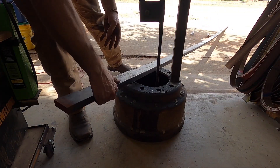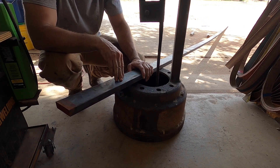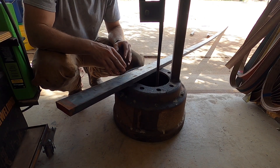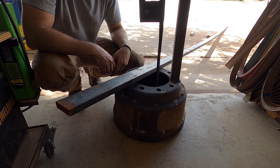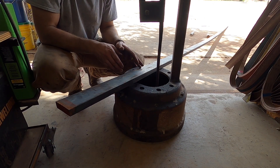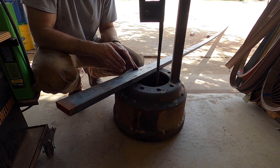I do know what happened. I cut a little slice off the new bar of stock and did its own heat treat test – a very simple way to make sure the steel you're working with has adequate carbon to harden. This is a brand new 20-foot replacement section, supposed to be 1060, but so was the last one. Somewhere along the line somebody messed up and a piece of mild steel got painted and mixed in with the 1060. It doesn't usually happen, but being able to verify your steel is useful.